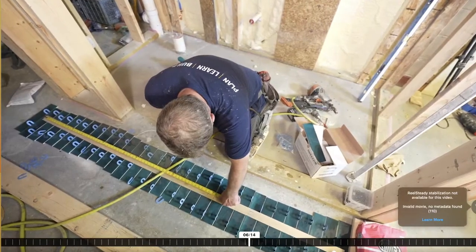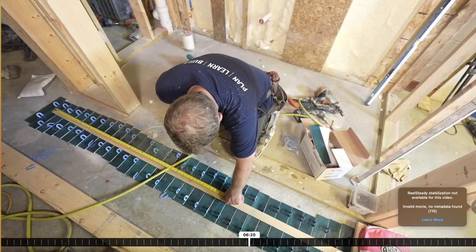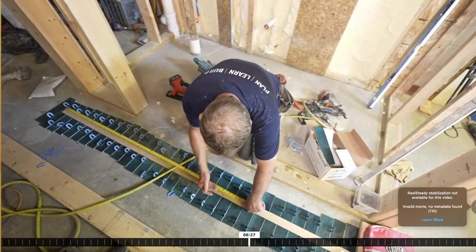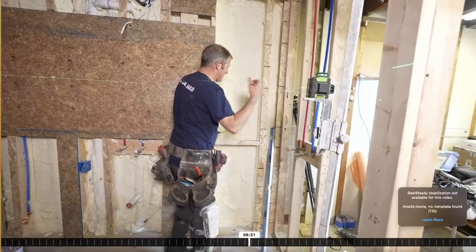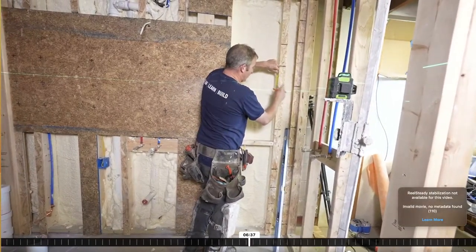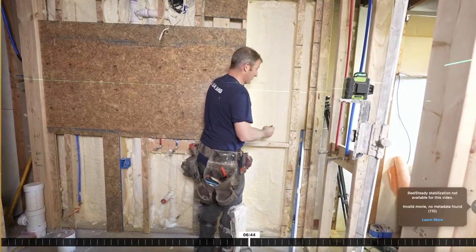So that's right in the half, right in half of where we'd be bending around. I'm going to say we either raise it or lower it so that we can get almost a full tile at the top, because it's going to look better to have a full tile at the top. So we'll make that 61. This is all custom, so you can make it whatever you want. We're just going to make it a little bit taller so that we can get a wider top. I don't want to cut that in half. Plus, I'm planning on mitering everything, so mitering right in the middle of the tile is going to be pretty difficult.